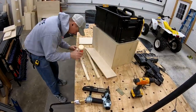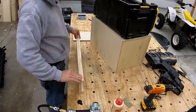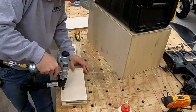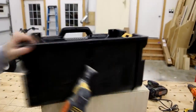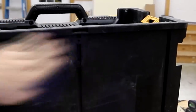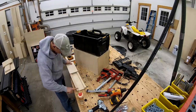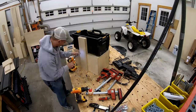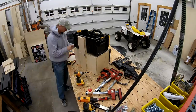I used three-quarter inch plywood as my spacer for the handle sleeve. I'll probably have to plane a little bit off the handle later, but this was just easier and that way I had the plywood grain oriented for maximum strength. I threw some Bessey clamps on it to make sure I had a really nice strong glue joint. For attaching the sleeve I used some beefy screws with a hex head and washer so everything is tied together and glued really well.